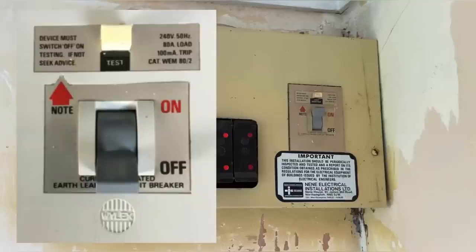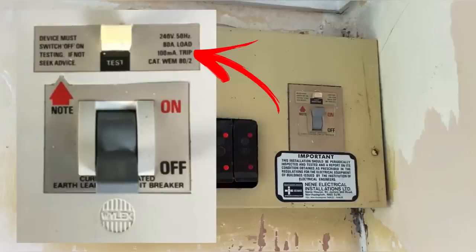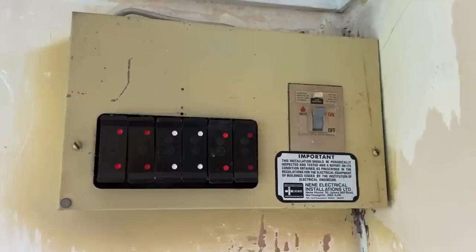However, it's also a residual current device - it's an RCD. So if that's the RCD, it should be offering additional protection. From our classroom lessons, we know that an RCD rated at 30 milliamps or less will offer additional protection. However, this RCD is actually rated at 100 milliamps and therefore wouldn't offer that protection. And by having an RCD as the main switch, the other issue is if it operates under earth leakage conditions, it disconnects itself and all the circuits attached to it - all six within the installation. That's not very good from a selectivity point of view, so all the lights and sockets would go off.